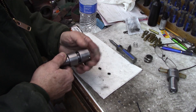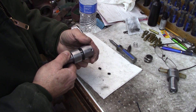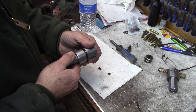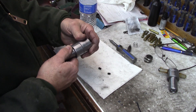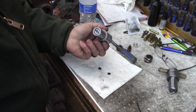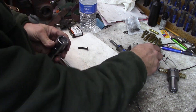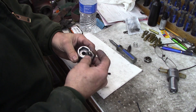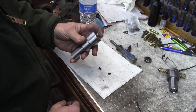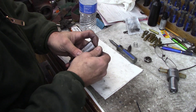We'll set it down in here and lock it into position. It will feed in off the tailstock, come up against the stop in the turret, continue to advance until it reaches the end of the dog, then it breaks free and spins. Then we stop the lathe, back it off a little bit until it re-engages on the drive dog, throw the machine into reverse and it'll unscrew itself. There's the body of it — and this is the die I'm setting up in it initially.